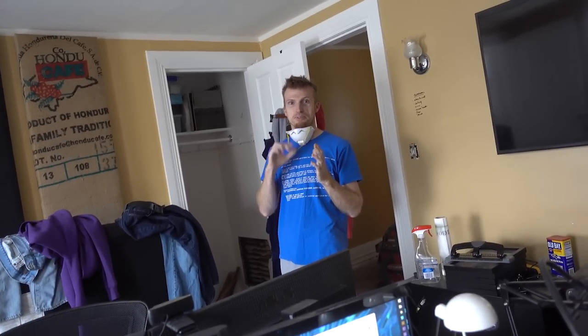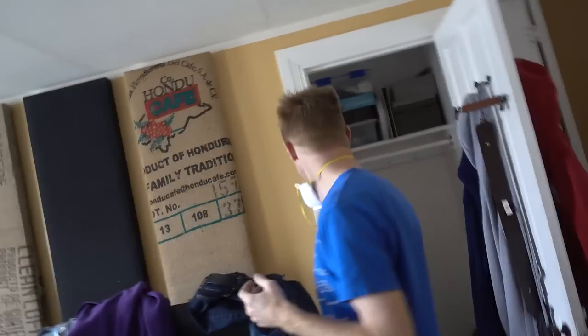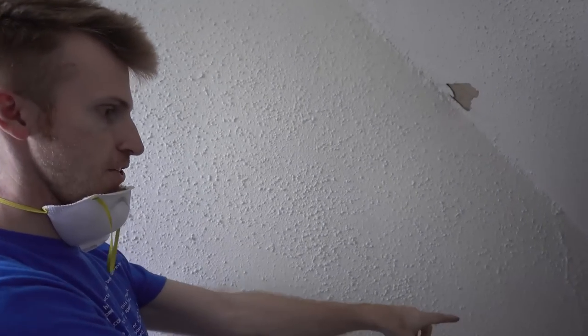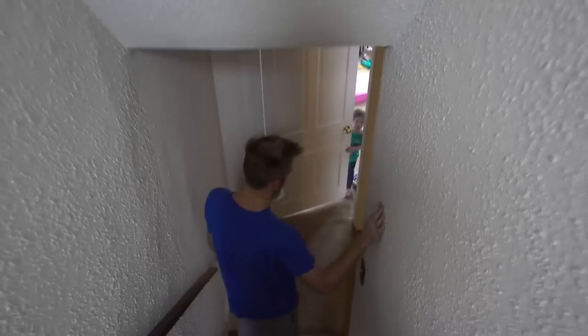The fact that I'm wearing what's almost a surgical mask is probably not good. Gloves. We must explore — we must see where the cancer lies in this house. We've already found that; it was on the first floor. Everywhere, I can tell you that. I think we're going to need to open that, at least all the way across, because we've established that at least for this chunk the joists run in this direction, which makes sense because it's a stairway. You can't do it that way — that actually does make sense. So I'm hoping that, at least for here, it runs this direction. I don't know if they then switched to run the other way. You're going to have to pop this baby open and find out.